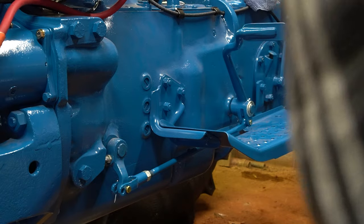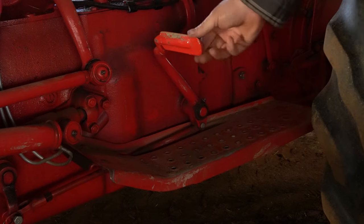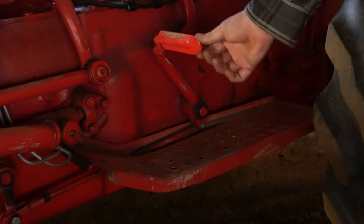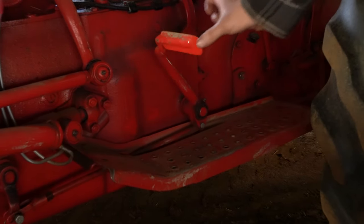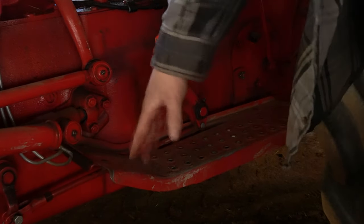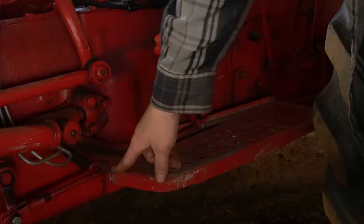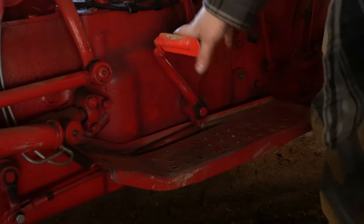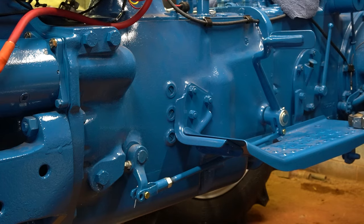Come over here to my 861. This one has new bushings in it but the pin is worn and you can see all the slop there, even the back motion. This pedal I cannot get the adjustment right because of that. You can see how far up the pedal is from the running board - it's not adjusted properly. It does work though, but it's probably eating the clutch up.